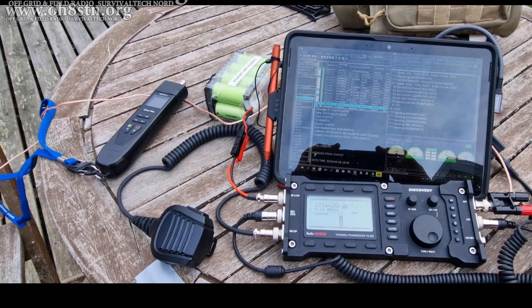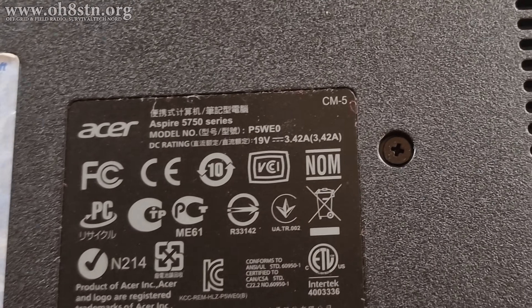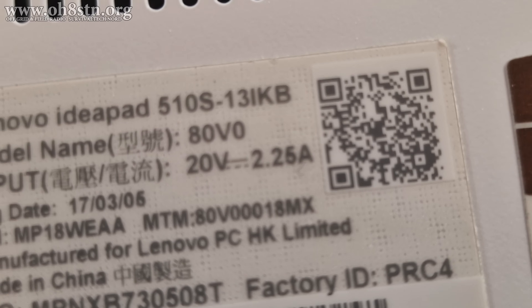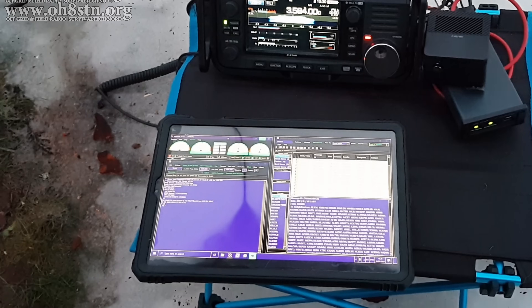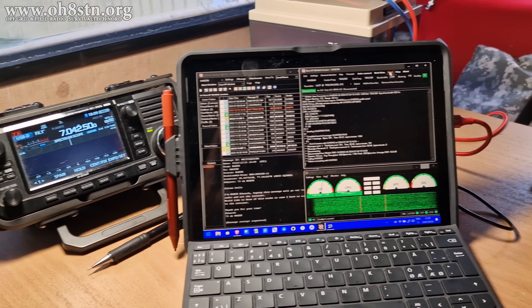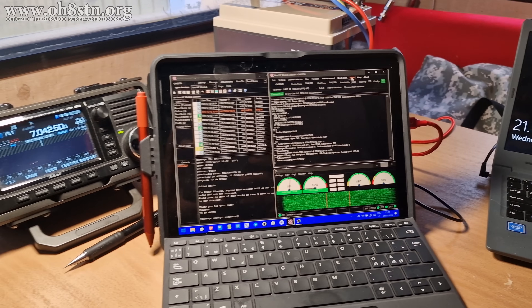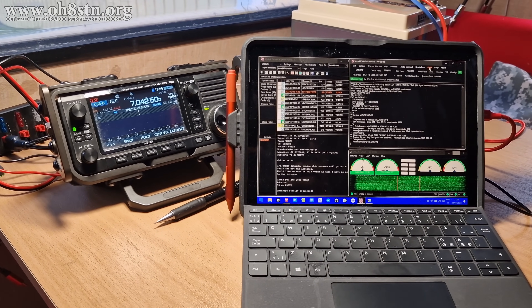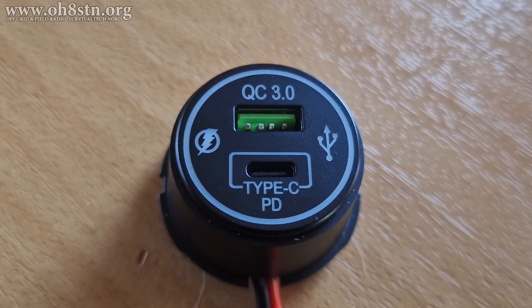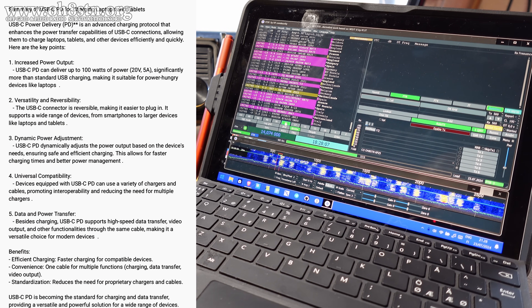Before we really get going, it's important to take a moment to talk about choosing a tablet or laptop for ham radio communications off-grid. Most laptops and tablets utilize 19 volts or some proprietary voltage standard to charge up their internal batteries. This is what we don't want when we're off-grid and in the field. We want to use what's called USB-C power delivery. A laptop or tablet which uses 12 volts natively is also okay. Most often we see laptops and tablets using some proprietary standard — that might be 20 volts, 19 volts, 17 volts, or in very few cases 12 volts natively. But what we're really looking for these days is laptops and tablets which charge over USB-C power delivery.